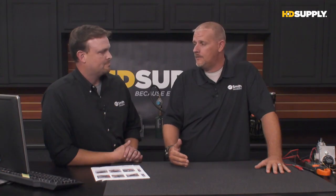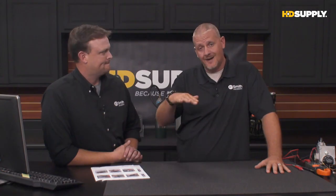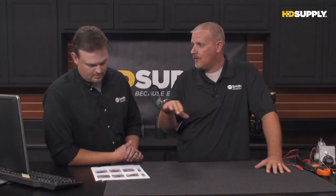Also, we talked about a lot of times these water heaters are in a closet, and again, there's Christmas trees and winter coats and everything else in that closet as well. And maybe that closet door is not cut properly. A lot of times they leave a little bit at the bottom. They'll cut it high over a high pile carpet and leave a little bit of gap. Well, sometimes carpet gets replaced, right? Maybe the new carpet's a little bit taller and it closed up that gap. It may be choking the heater down.